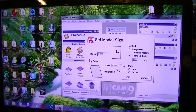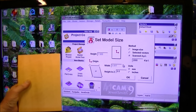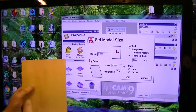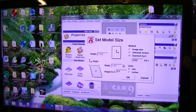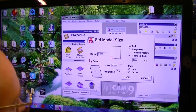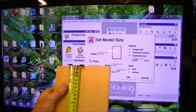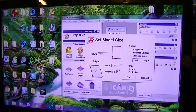If I grab this piece of material here, which is what we're going to actually cut this into — at the moment it's set for the center of the material. But in this case I think we're going to start off in the bottom corner here, so we can alter the orientation. Before we go any further, I need to measure this piece of wood. This is 150 by 150 by just under 200 millimeters. I want to leave a slight border around the outside so I have somewhere to clamp it, because the tool will travel all the way across.